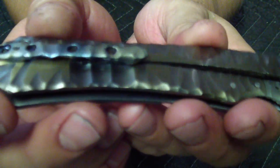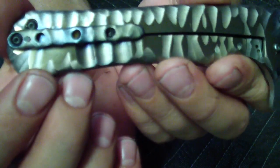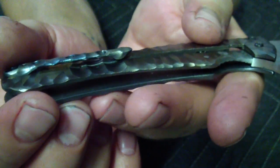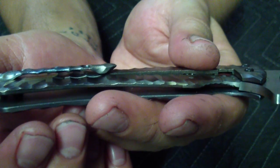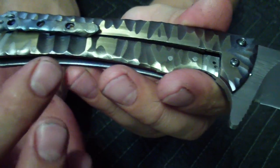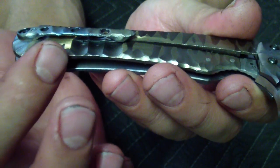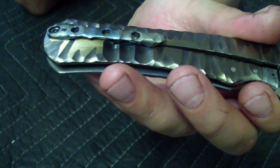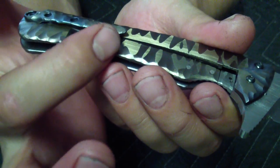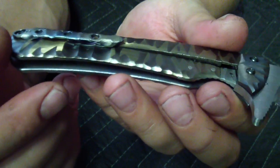Another thing also, a new experiment I'm doing. I was talking to one of the people that got my frame lock, and I had some issues, and I gave this a try, a kind of triple groove like you see on the Spyderco Saturn. I don't see really any difference. I think it behaves the same way, and it's hard to say. I would have to make two exact ones to compare the whole action and the detent and everything, but I think it doesn't really make a difference if it's this way or the other way, how I did it before. This is like three half-inch diameters next to each other. Before I used to do a two-inch diameter, one larger one. So in the end of the day, it really is just the amount of titanium in a certain area and the length of the lockbar that really plays a role in the springiness of the whole thing and the whole action.